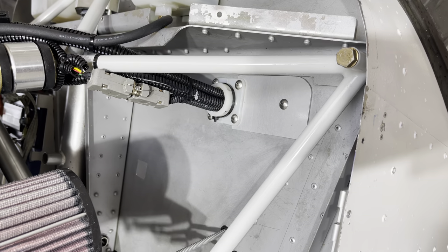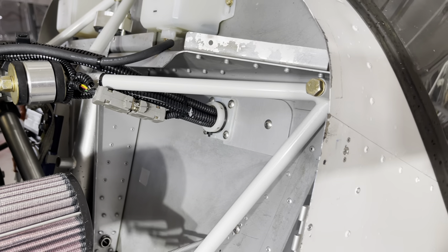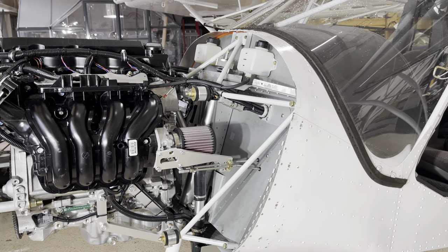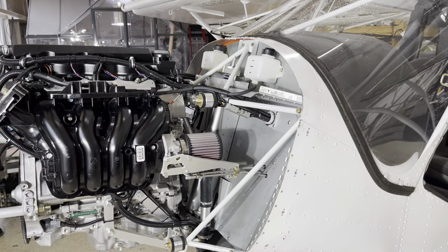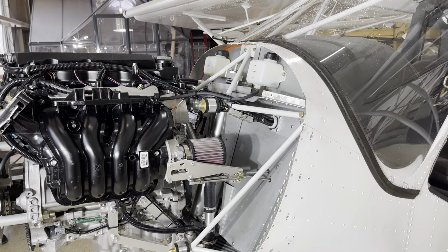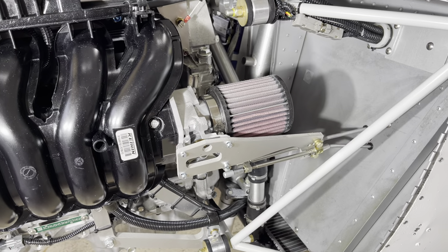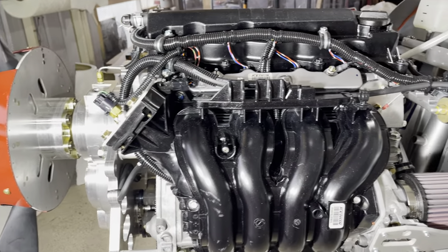For the engine, eventually you're going to have cables or wires going through for your engine monitor and things like that coming inside the airplane. You're then going to support the ECU and plug the connectors into it, and look at all the labels on the individual wires — they're going to be terminated in different places. Cut a hole in the firewall adequately sized and get your ECU bundle through the firewall; be very careful not to chafe against the sharp edges.